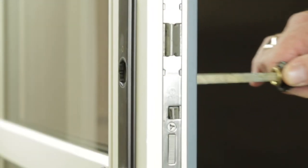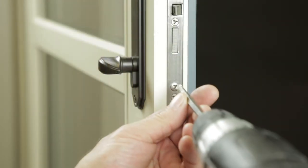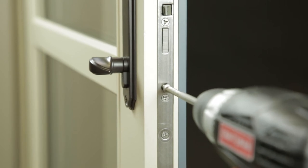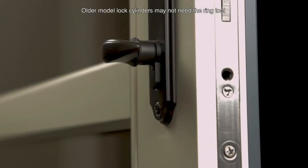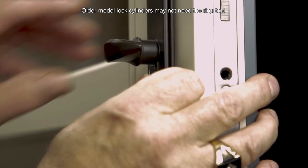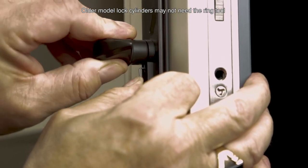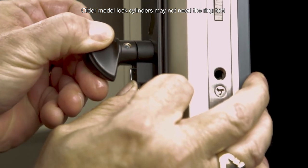You can now pull the outside lever and attached shaft out of the lock case assembly. To remove the cylinder lock, remove the cylinder screw located along the edge of the door panel. Use the provided ring tool to disengage and turn the cylinder shaft until the drive tab is aligned with the cylinder. The drive tab must align with the cylinder to remove. Once the tab is aligned, you can remove the lock.